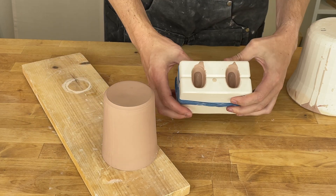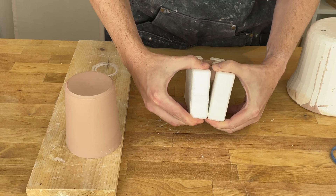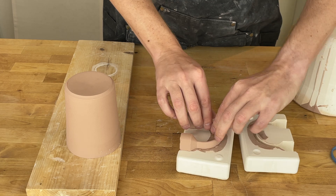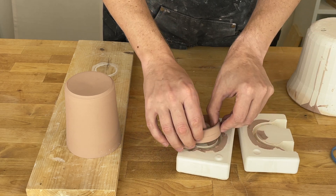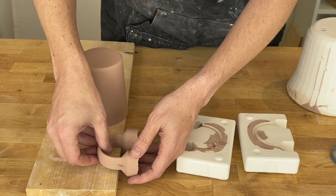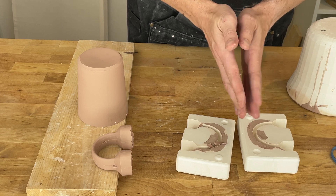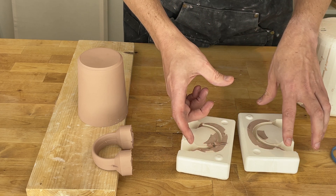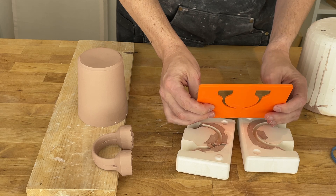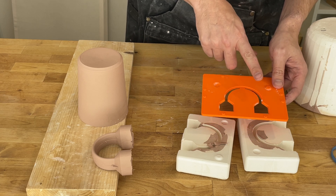There's the pot and the handle. I got a bit more flash on this one — I'm guessing that's going to clean up all right. There could be a few things causing the flash. One is that maybe I didn't get the parts exactly aligned together. These mold keys or notches have a little bit of tolerance in them because the 3D prints aren't exactly perfect, so you might need to move them around a little bit. Another possibility is the 3D print itself isn't perfectly flat — I'm thinking about options for dealing with this, like lapping it if you really want to have a good seam line.